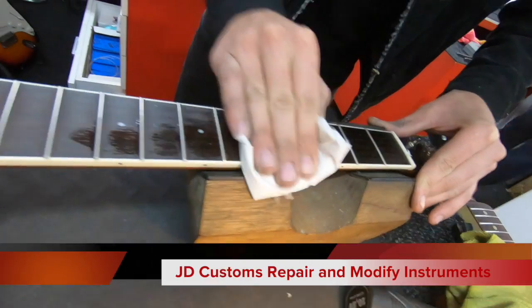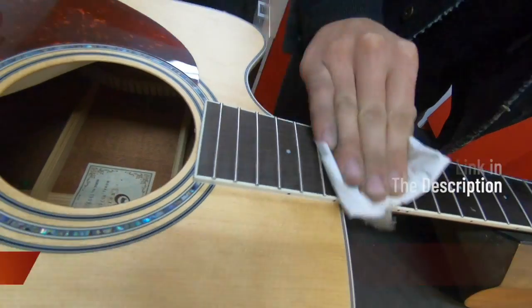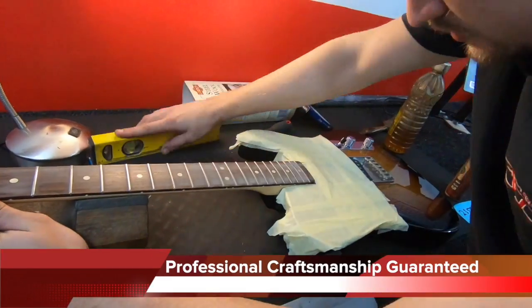So you play your guitar, you get a very small signal, you put it into your amp, and it gets amplified by the preamp tubes. That's where you get all your textures, all your timbre, all the nice sound from. It gets sent to your power tubes, then from your power tubes you go to an output transformer, and then it goes to your speaker. The task of your power tube is to replicate that small wave and make it bigger so that it has the power to move that speaker.